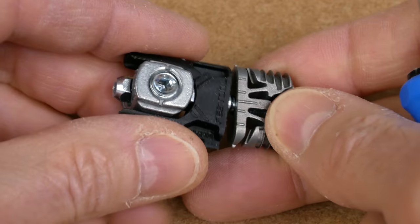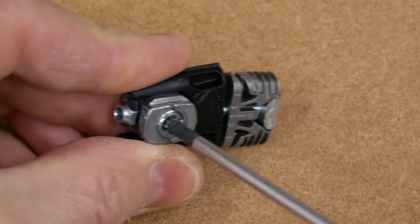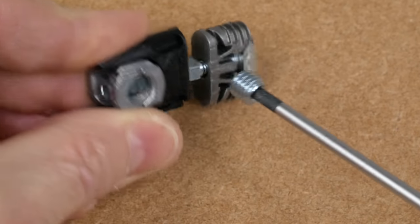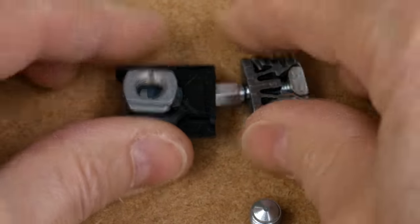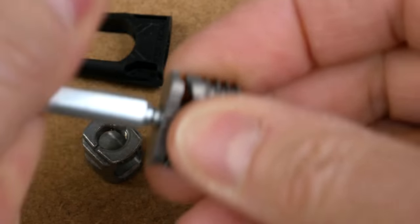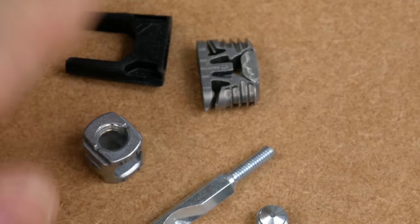I've got to be honest — I'm not a fan of these fittings. It was these Connect fittings for the smaller Domino that convinced me that I needed a Lamello Zeta. But if you need a knockdown fitting and you have the Domino, then this is pretty much your only option. The Connect is a well-made, mostly metal fitting that's made up of five individual components per joint.